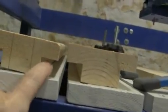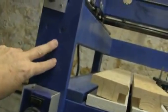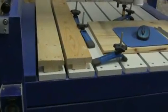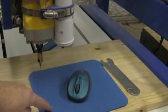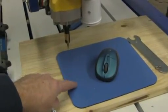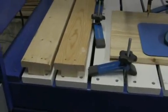There's enough thickness here — these are cut three-quarter inch by three-quarter inch on both sides, then they're screwed down and mounted. I'm also lengthening the legs an additional three inches on the new table for the CoLab. What this does is allow for the table to accept the two-by-fours instead of one-by-fours. It also gives you more length in your Z-axis. Right now I've got about two and a half inches of travel from the tip to the table. With raising this up three inches, we've got almost four inches of travel. That'll be a big plus, and using the T-slot will be just a real joy to do.